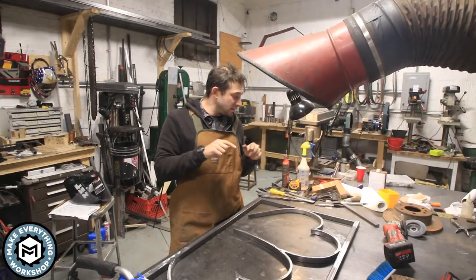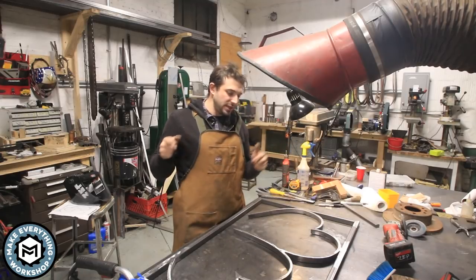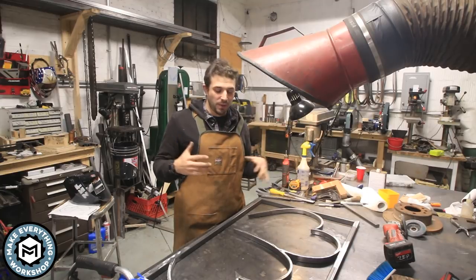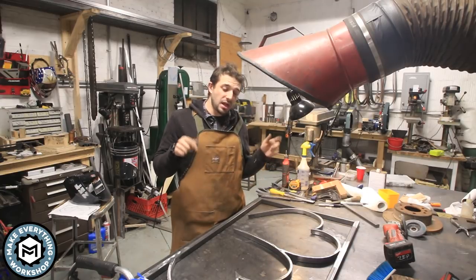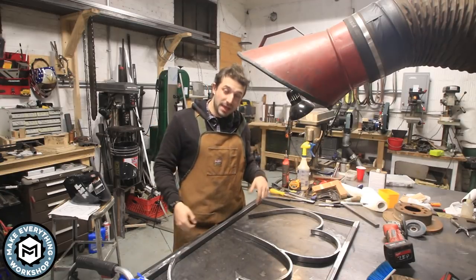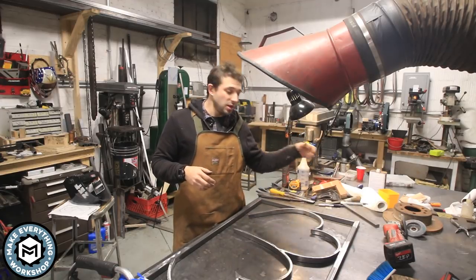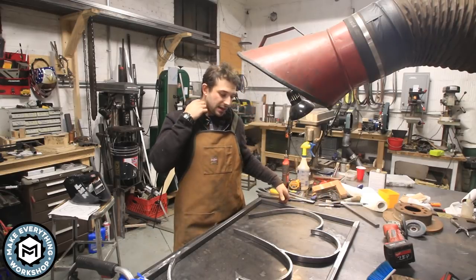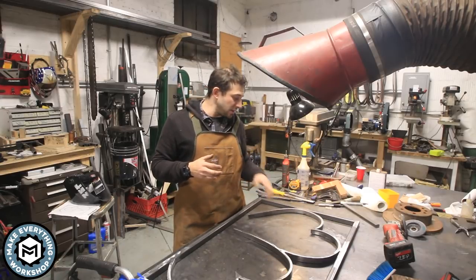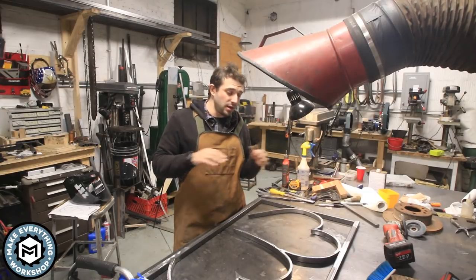Now I have the dimensions of the pergola that this is going in. And while I could try and build into those dimensions in air, I always feel more comfortable building into a space. So what I'm gonna do now is just make up a quick 2x4 frame that is exactly the width of that pergola and then clamp it to the table and basically work within that. Now I'm using a weld-on pin hinge for the two sides over here, and I think the way the weight is distributed with more of it towards this side, I'm actually gonna be in good shape in terms of the balance. So let me make up that 2x4 frame.